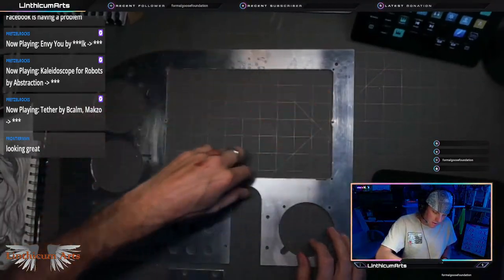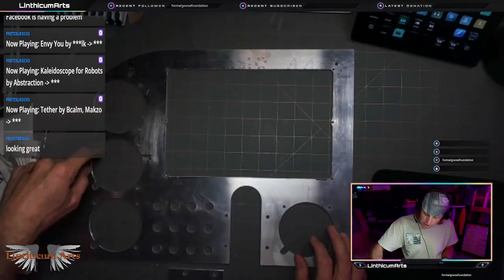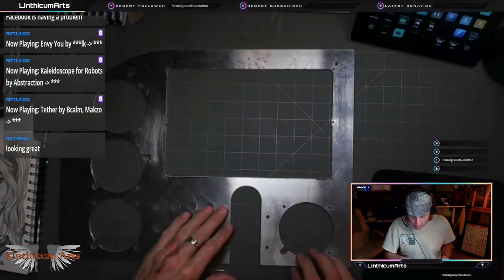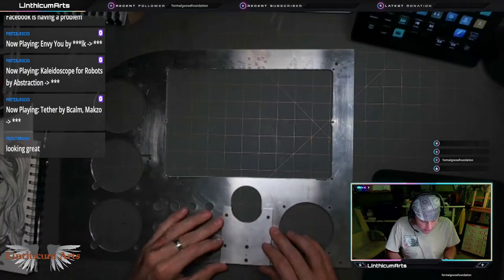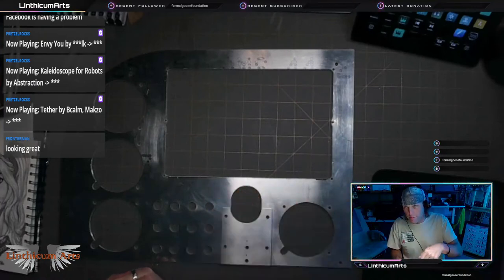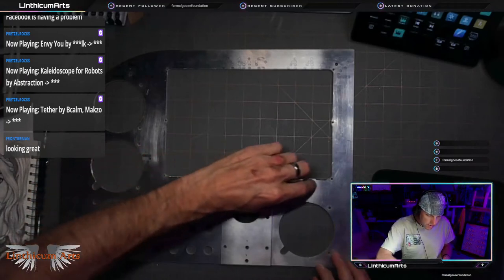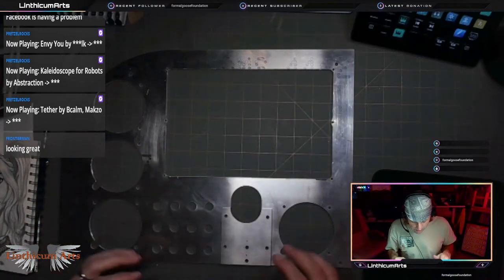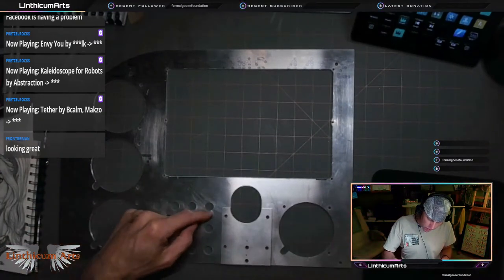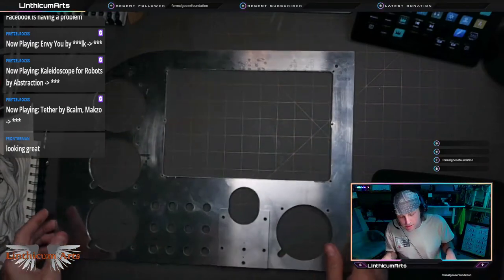We're going to have this flat display, a G500 display. We'll have the airspeed, a digital altitude, turn coordinator, and this will be a nav area, and this will be for circuit breakers. I did this all up in the Autodesk CAD program. That's a cover plate that'll be for the yoke coming out of the aircraft. I just had to do some cleanup, some smoothing out of some of the areas, so everything fits nicely. Then it'll go off to powder coat, which will be a nice black, and then we'll take it to the laser engraver where they'll put all the markings for what each breaker does and any of the placards on it.